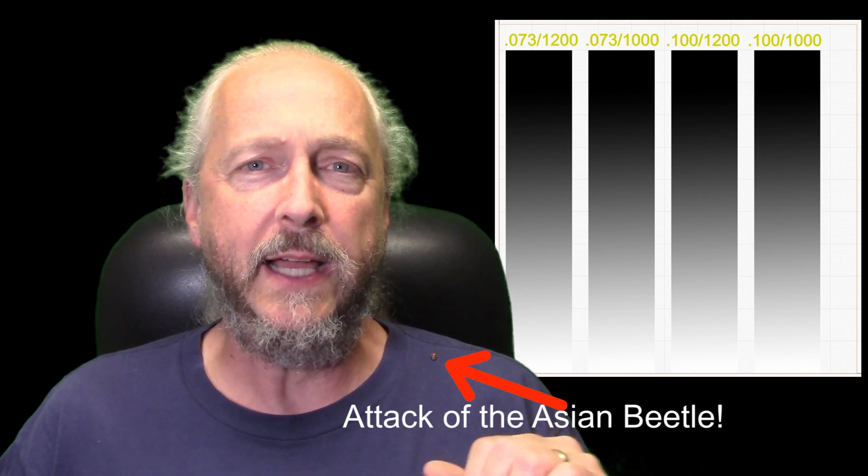On those I did a similar pattern to the first four. I did a basic gradiated pattern and I'm trying it at two different burn speeds and two different resolutions. One I did at 350 dots per inch and the other at 0.1 millimeters per line, which is basically 10 lines per millimeter. The 350 lines per inch translates to 0.073 millimeters per line. I wanted to see if the resolution and speed were having any effect, along with the thickness of the coat of paint.